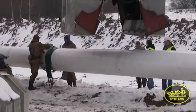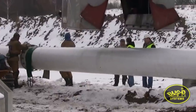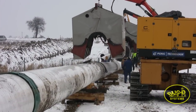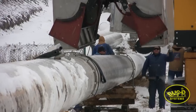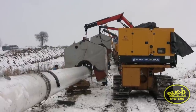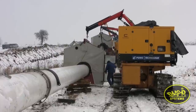The welder at the left of the seam can be seen mounting the ring to the pipe. This ring will stay in this location throughout the welding process. Each shack is moved and located over the weld joint for each subsequent pass. Once all of the passes are complete, the ring rail is removed from the pipe and carried from the back of the string to the front, where it is installed as soon as the root pass is complete. Here we see the ring rails in place on the pipe as the tractor moves the shack forward. The welders provide direction to the tractor operator via hand signals for proper positioning of the shack over the weld. The shack is lowered onto the pipe, the doors are closed, the floor decking is dropped into place, and the welders enter to begin the next weld.